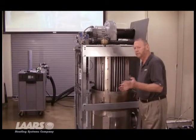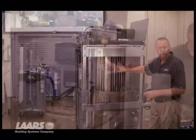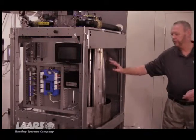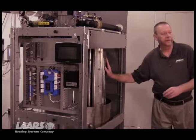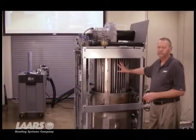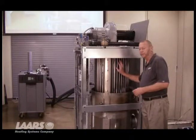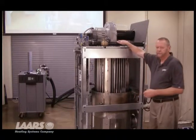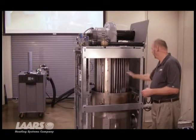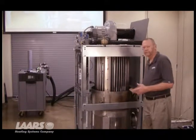Once you get all the baffles taken off, if these tubes were dirty and needed to be cleaned in any way, this is when you could go in there with your water, brush, and vacuum cleaner — depending on how bad it is — to get these clean. If the heat exchanger is really plugged up, it can also be cleaned through the burner itself to get access on the inside. But typically this is all you're really going to need to do — wash it down and it'll drain itself out to the condensate.